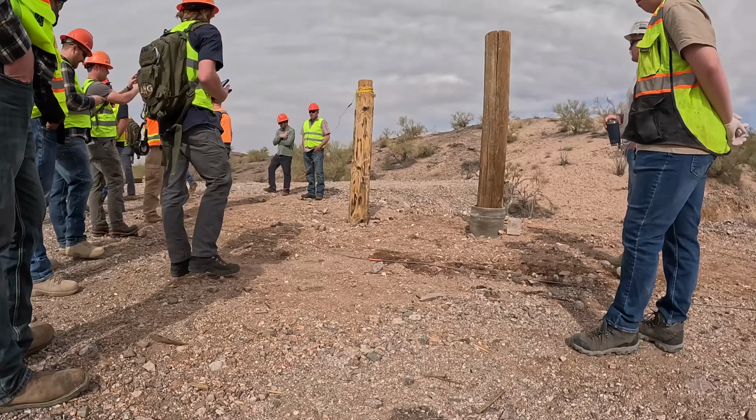So what these guys are doing is they're going to demonstrate the Monroe effect. Instead of using copper, we have aluminum. And the C4 placed on top of the aluminum, it's not 42 degrees, but 45 is just as good. It will cause the C4 to explode, and then all that force will be directed down towards the metal, and it will cause the aluminum to become a hot metal slug, and it will punch right through that steel. It's called hydrodynamic flow. So the slug heat will basically penetrate the metal and just cut through it like butter.